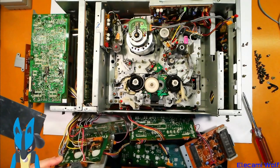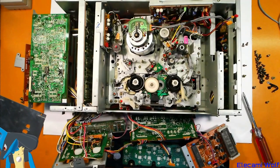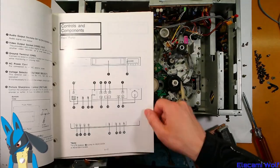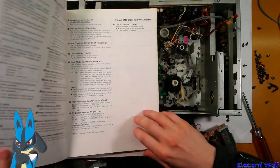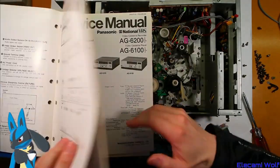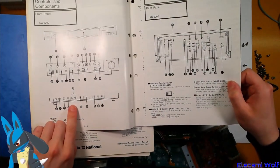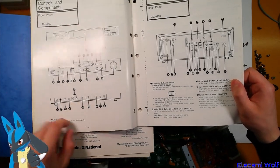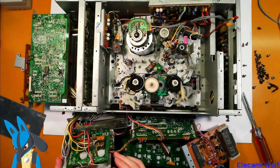There's provision for two microphone inputs and the preamps related to those, and a slow tracking control — but none of that stuff is fitted. Does the one with the search dial have slow tracking control? It does. The 6200 has got the slow tracking and the microphone inputs. So they must use the same blank PCB and just have more stuff fitted on it.